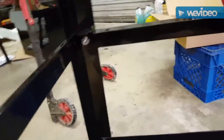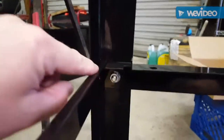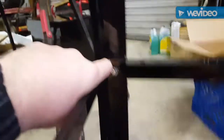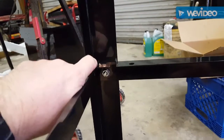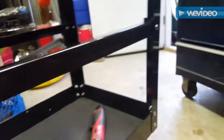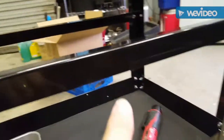All right, here's one of the things the instructions don't tell you. This lip for the sidebar, which is the short one, has to go over this one so the screws will line up. And see, they're still not lined up, so you don't want to tighten any of these yet. The instructions don't say any of that, but you don't want to tighten any of those until you get everything done. I don't have the instructions, but you can barely see it on the instructions.